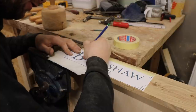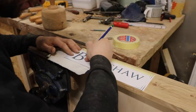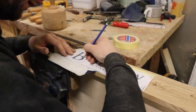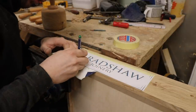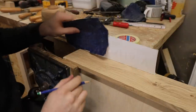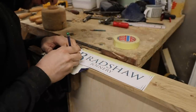Now this doesn't look like a true letter carving font because the B is quite oddly shaped. Yeah, so it should be interesting to try and follow. I'm not drawing all the way up the vertical uprights or the horizontal parts, so I'll just mark them on through the transfer paper with the end marks. And I'll draw them on with a combi square in a minute, so I'll get nice straight lines for them points. And that makes all the difference in the quality. I'll just have a cheeky look, see how it's coming on. Not too bad. This is a well used bit of transfer paper, so I have to keep moving it to make sure it actually marks the paper.